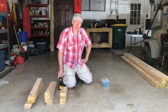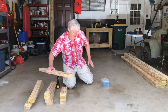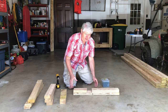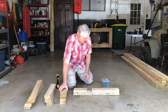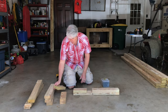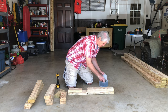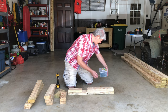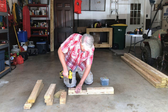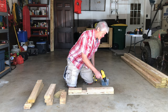Now let's assemble the legs. I forgot to mention earlier you're going to need a power drill if you're using 2.5-inch deck screws. We're going to take a long leg, an upper leg, and a lower leg to make this piece. You can see there's a gap right here — that's going to serve as a place for the cross member to go in. We'll put just a few deck screws, staggering them. I really like these Grip-Rite Prime Guard Plus screws from Lowe's.